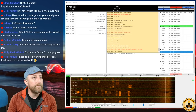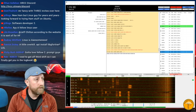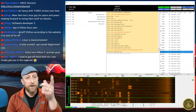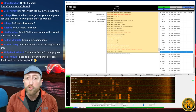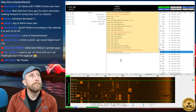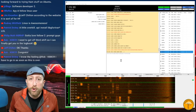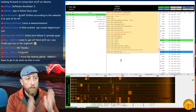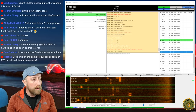It's going through multiple 15-second passes at this point. Whether or not it gets through, that's how you relay: use a station that can hear the station you want to talk to, and go through that secondary station. That alone is a major feature of JS8Call worth learning — a very important skill. That's why we learn this stuff: it's useful and important to know.